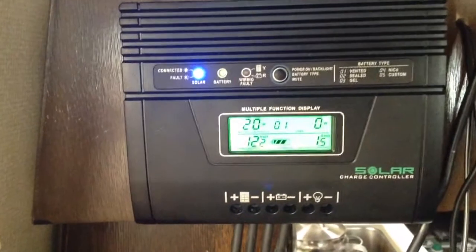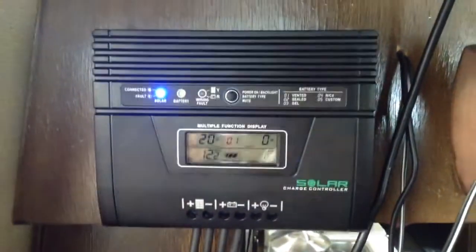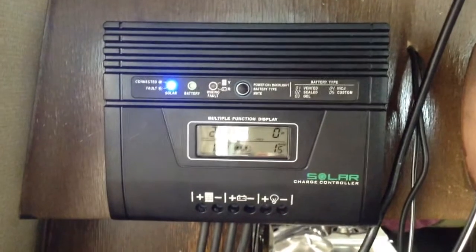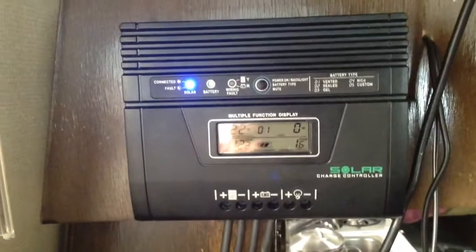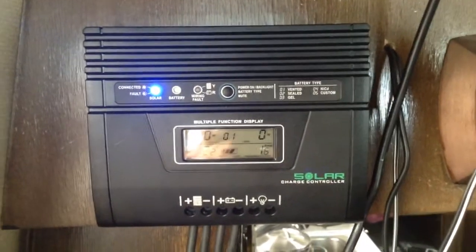The system is self-diagnostic to a large degree. These little indicator LEDs can actually change color if you've wired something wrong, which is nice. I had originally wired the panel voltage on this backwards, and it didn't tell me — I had to take it off, play with the multimeter, swap stuff around, and then I was able to get something out of it.